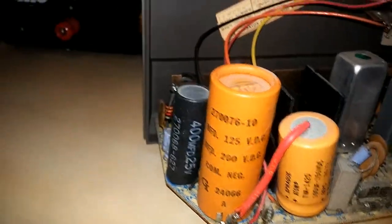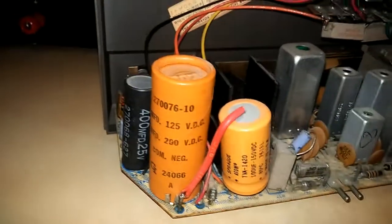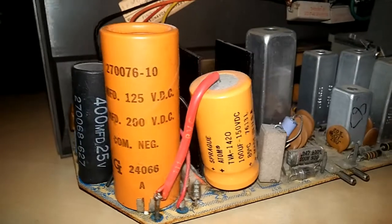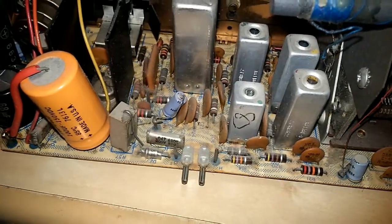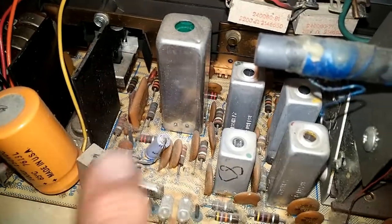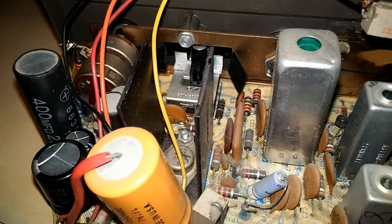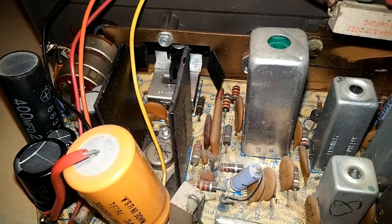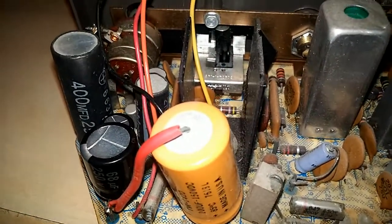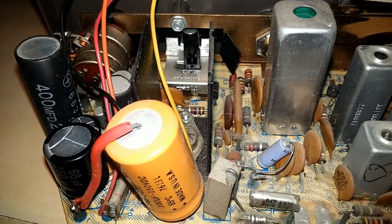The one on the left is the one I need to replace. I've got 68µF at 250V and 47µF at 160V to replace 50µF at 125V and 70µF at 200V. While I'm in here I went ahead and ESR'd the other electrolytics in the radio. This 5 microfarad near the discriminator or audio section tests wide open, and the 400µF power supply one is borderline but still barely within the good range, so I'm going to leave it.